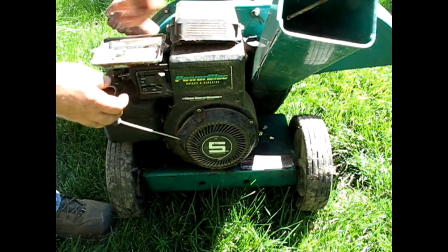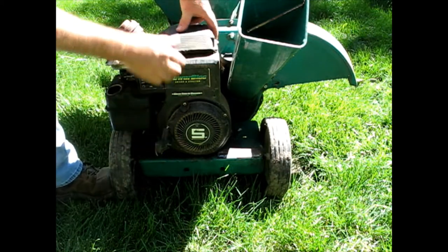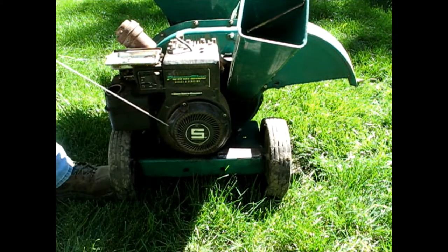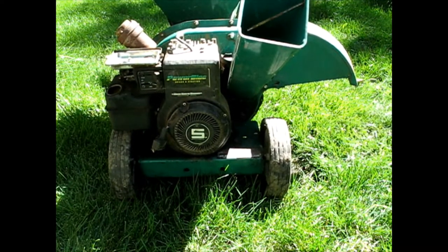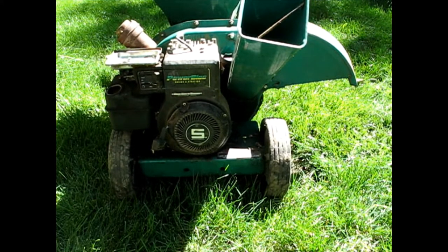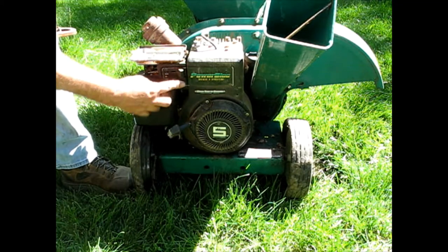I'm going to try with the choke on fast. I think there is still some water in there but that'll come spraying out. It fires immediately! One thing about these is you just got to pull hard and steady because there's a lot of mass with the flywheel for the chipper — that's also why it doesn't die quickly. It doesn't sound like we've got a bad connecting rod. Everything sounds good; valves must be opening and closing. Let's give it some real fuel.